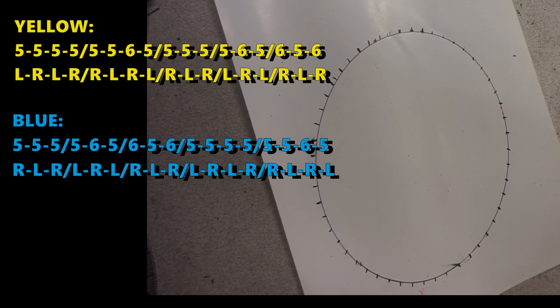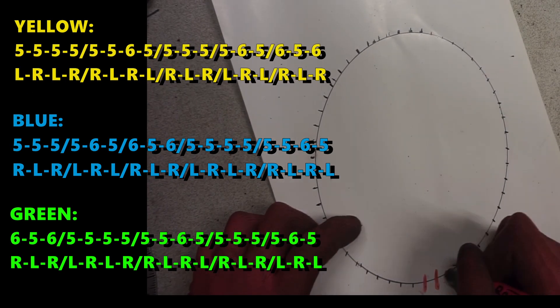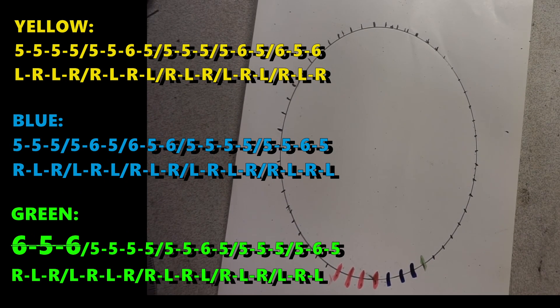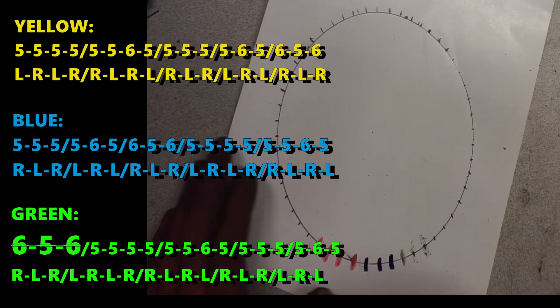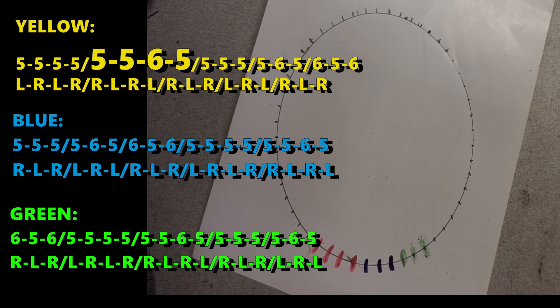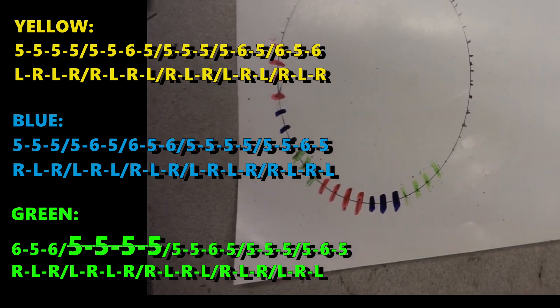So when you wire it, you're going to do 4 turns — 1, 2, 3, 4 — and then you skip the next 2 phases, which is going to be 3, 3, and then you start again afterwards. After you do the 2nd set of 4 turns, then it's going to be skip 3, and then skip 4, because the next phase is going to now do its 4 turns.